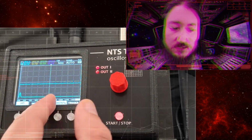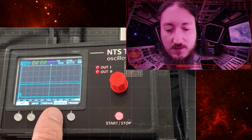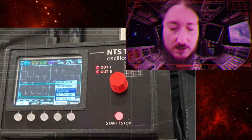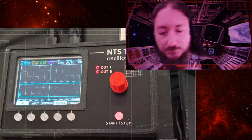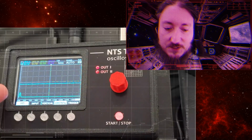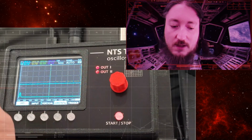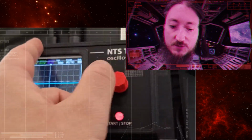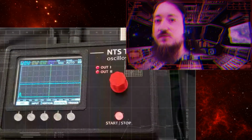So right now the middle is set here at the 1K, but you can change that if you want. You can change the divisions, but what is most useful here is to change the range. So right now I have set the range from 0 to 2K here. And as you can see, unfortunately there's always a spike below 100 Hertz. Even when you don't have any input, output or USB power, so it's just getting powered on the battery, there will still always be noise, unfortunately.